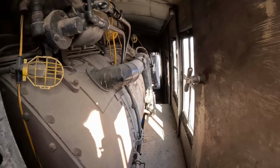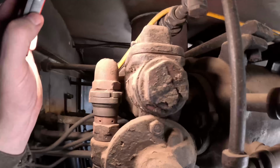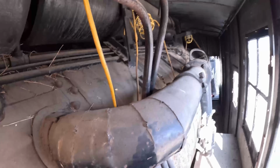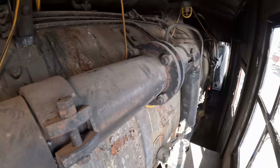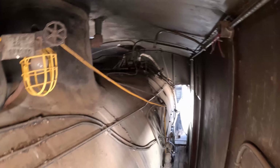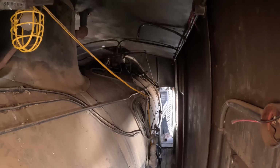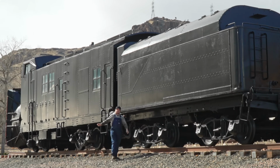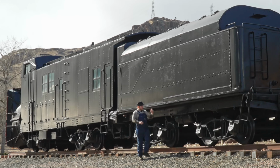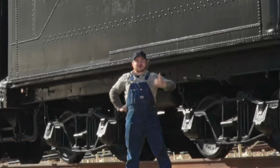And now let's go down the fireman's side. Ugh, if I can squeeze through here again. Here's your 6ET distributing valve for the automatic air brakes. Another branch pipe running down here, and a check valve for water to be put in the boiler there. And everything runs back, and you have more appliances to start on the turret, just as you did on the engineer's side. All right, well that about does it for a tour of a real rotary snowplow like we have at the museum. Why don't we take a look at one that actually runs?